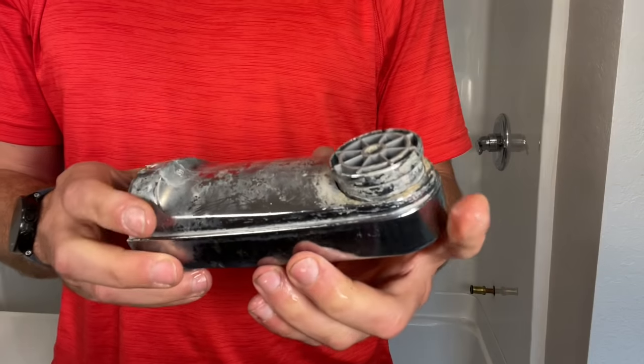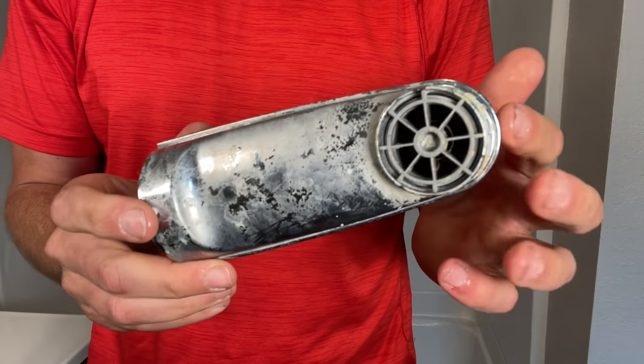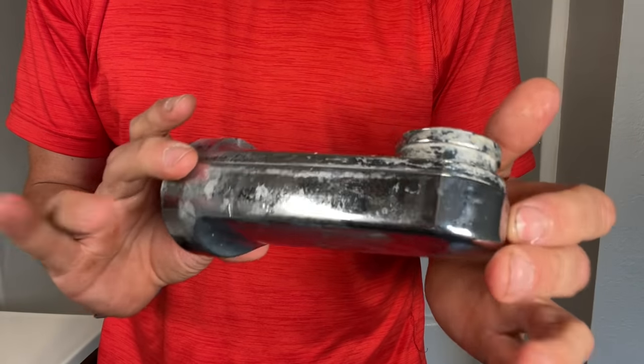That's how you divert the flow from the tub spout up through the shower head. Now if you have a bunch of mineral deposits that built up over the years, the gate that shuts the water off at the tub spout can become blocked or partially blocked — so although water does flow through your shower head, it's partially still open and you still get that little bit of water coming through the tub spout.